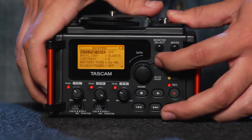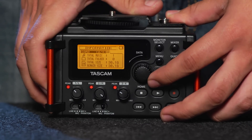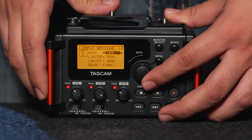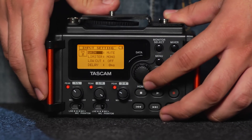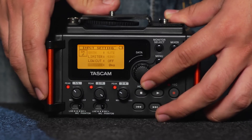From the main menu, if you click Others then Information, it will display what all of our custom settings are set to. If we're using multiple microphones, we can adjust what each of those input settings are set to. In our main menu, go to Input Settings, and the first one will show our channel one microphone. We can change the gain to either mid, high, or low. We can set a limiter or a low cut filter. If we scroll down, we can adjust our other channels as well.